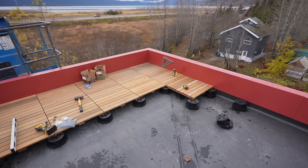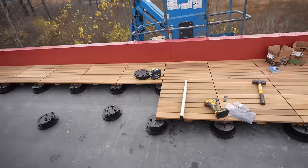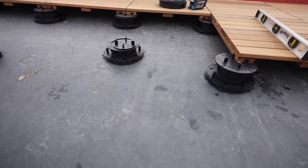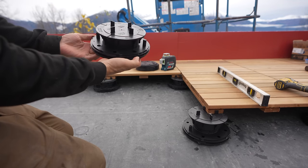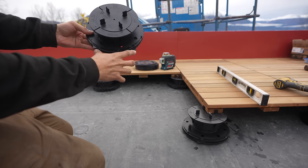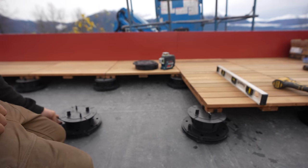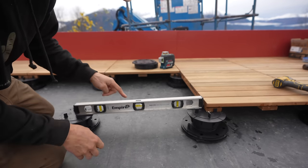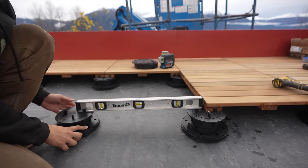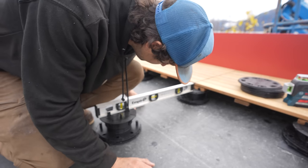Here's a little update on progress — moving across here right now. I have the pedestal, I'll adjust my slope to one quarter with the tabs 90 degrees apart, point that down towards the rooftop drain, and set it into place. Use the two-foot level in between the first two pedestals — you can see how that's out of level, so we bring it up to level. Check the back — that's perfect. Now we're going to prep all the washers and screws so we can tighten everything up easily later.